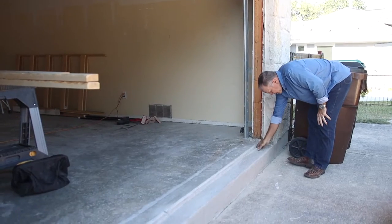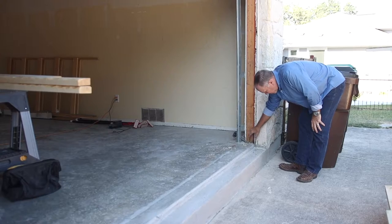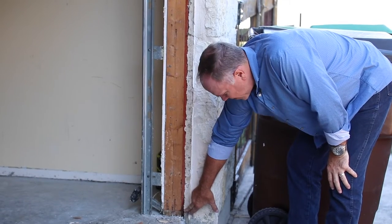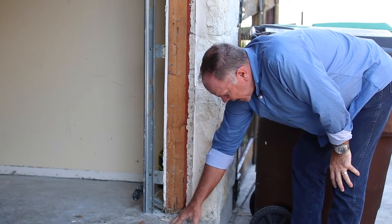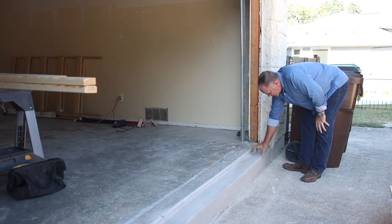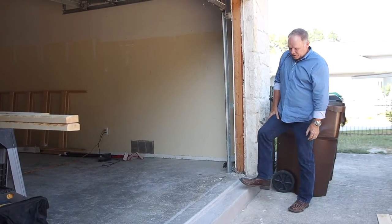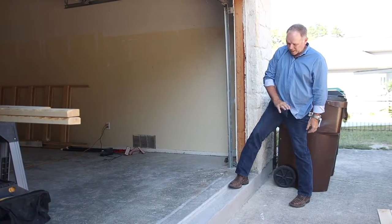Another thing you see is that the right way to do it is to have this an inch and a half lower here. This allows all the moisture to come down a wall, as you can see right here — that's how it was done originally. This is where the stone is an inch and a half lower than the wall itself, and it's got a moisture barrier that goes underneath and across. When Dan and Elio frame this wall, they're going to put a moisture barrier that comes out under, and then the stone is placed on that. So moisture cannot go up — it has to go up this high to get in the wall, which is impossible. This is structural concrete; it can handle the weight of the stone and it will never let moisture in.